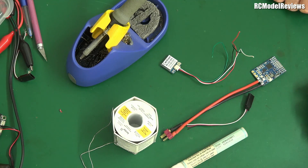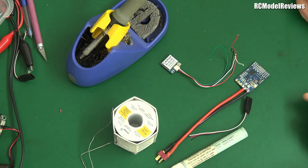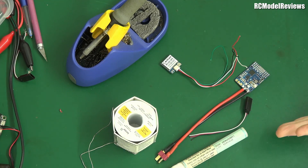So that's why soldering is important — if you get it wrong, you can damage things. Fortunately, I don't think we damaged this one; it survived. It's simply that the short circuit on the output of the regulator caused the regulator to shut down so it didn't work, but when we took that short circuit off and cleaned the board up, it all came back to life.